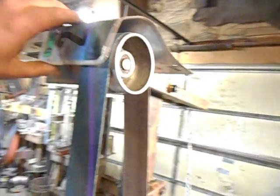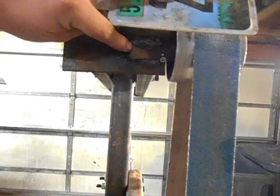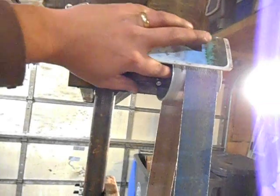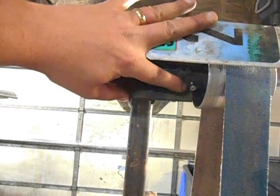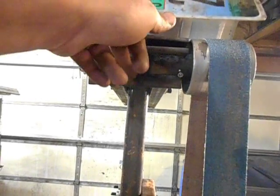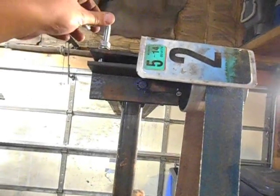This particular tracking wheel is a pretty common one you can pick up from Jantz Knife Maker Supply for about $60. To mount it, I took a piece of one-inch mild steel, drilled the hole out and turned it to fit within two or three thousandths on the shaft that comes out of the tracking assembly, then drilled and tapped the side for a set screw, and welded that whole thing to this piece of angle iron. This bolt goes through this piece of angle iron and through the other piece of angle iron so it pivots back and forth — you can adjust it with this right here.